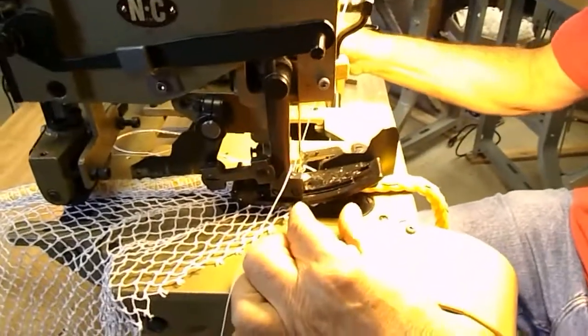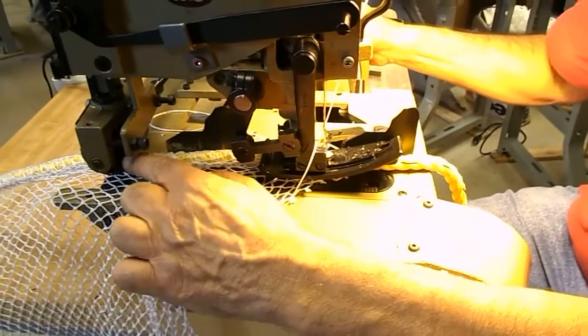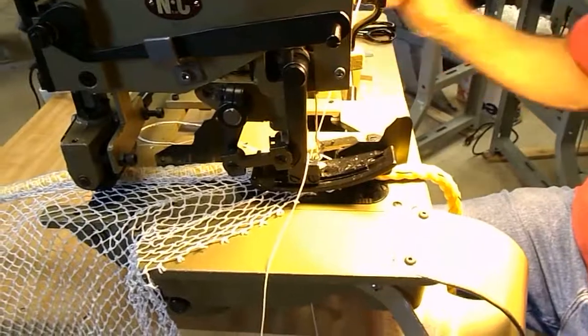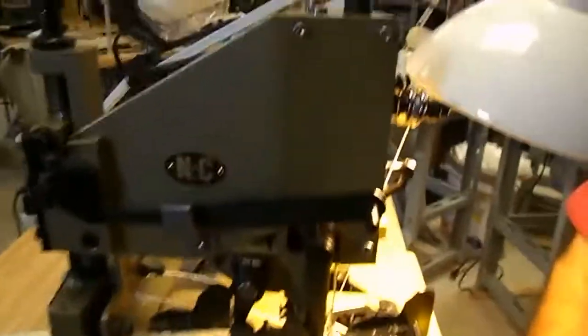Bottom teeth come and the top too, and together they pull. Now, if I shorten my stitch length, I want to make sure that I slow down my rear puller. You can't have one pulling faster than the other. You want to have them basically pulling uniform. Synchronized, right? Synchronized, that's the word. If you don't, you'll get bunching.